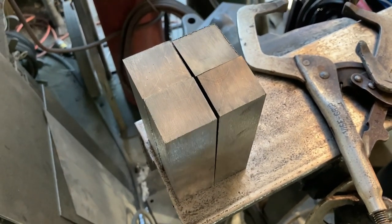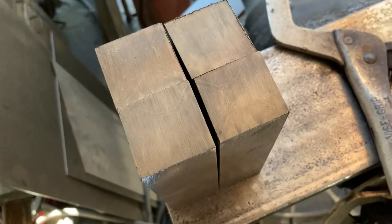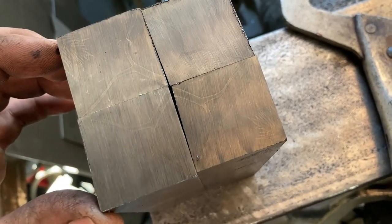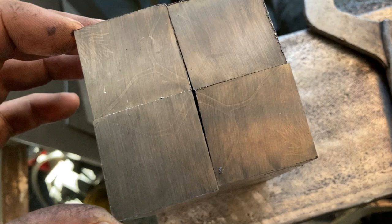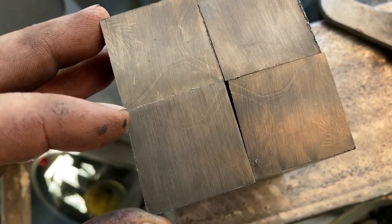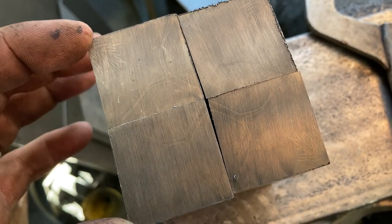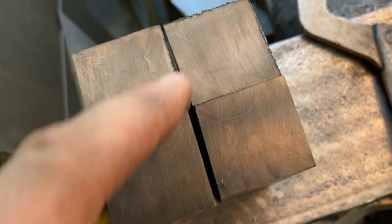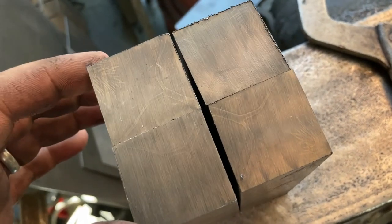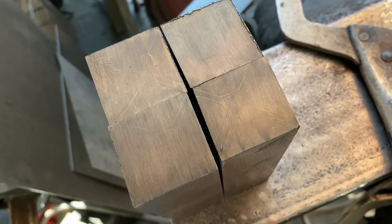After a lot of grinding — shimmed grinding on opposite sides, and then grinding down the odd rhombus shapes created by that — I've got relative squares again. You can see that the points here meet like they should: pretty close there, good there, not bad there, and they're touching in the center. So now I have a basic compass rose shape again, and now I can put my 15 and 20 shims in here. I've lost some mass off the billet but it's still pretty hefty, and like I said, I'm adding a little bit of metal back. We'll come back and have a look at this billet once it's all tacked up and throw it in the fire and have at it.